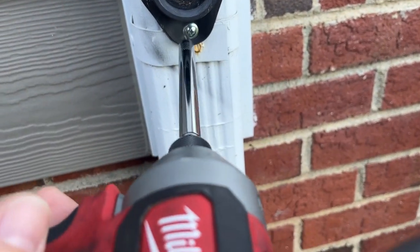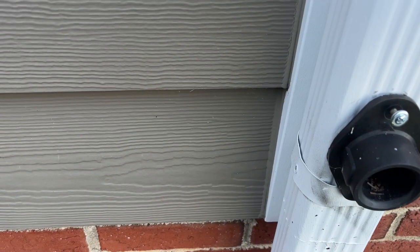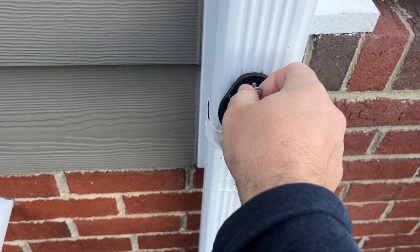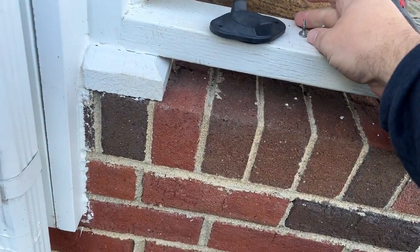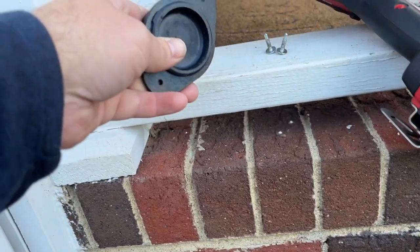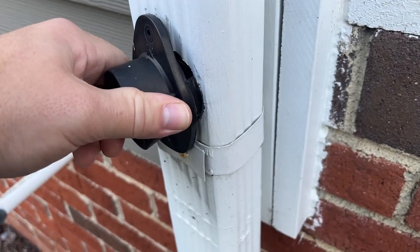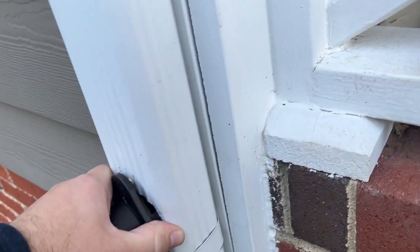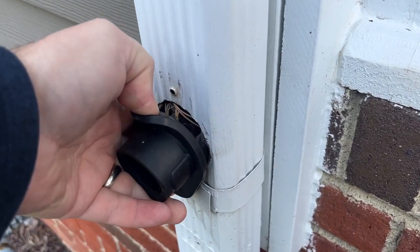That's one, and that would be two. Now I've got our two screws out — setting them up here out of the way. This is the part where we're going to have to be pretty gentle since we have metal against rubber that's fairly dry. I'm using my foot below to help stabilize the gutter since I'm doing this one-handed, and slowly and carefully working out this gutter tap.